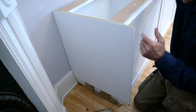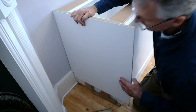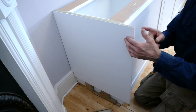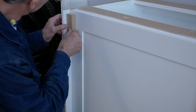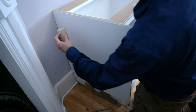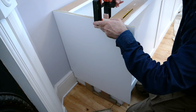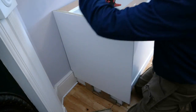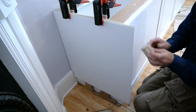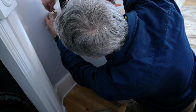With the cabinets fixed we can hang the doors, spending a little time to get them lining up nice and even. Sorry everyone, it's really hard to see what's going on here - the light's terrible and I'm jammed up into a corner. Basically this is the end panel; I've nibbled away a little bit of the base just to fit around the skirting baseboard so we get this as far back as possible. I've checked the front to make sure the overhang is even and I've got a couple of pieces of MDF set to the right depth - just going to pop a couple of clamps on to make sure nothing moves.